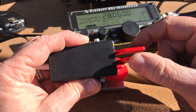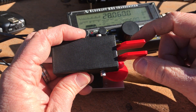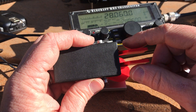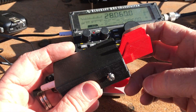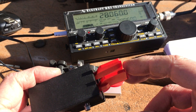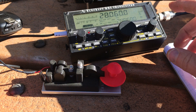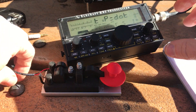I don't use the squeeze technique a lot, but high-speed CW operators do. I've watched people do it and it's amazing how fast they can go using iambic keying — my brain just doesn't work that fast. If you're using paddles, which I'd recommend if you're doing a lot of Parks on the Air contacts, it's just less fatiguing in the field. On transceivers like the KX2, you have to go into the menu settings to switch between paddle and hand key mode.